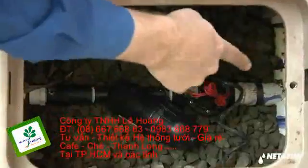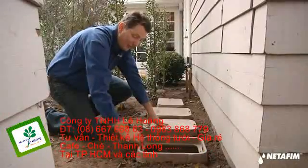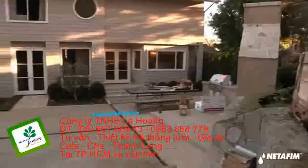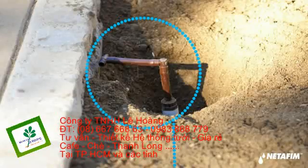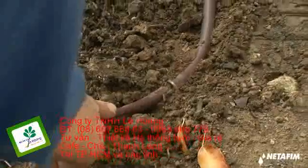You can see right here, the water comes through this mainline pipe, goes into the PVC pipe, starts here, goes across right below the soil — in this case 6 or 12 inches down — and the PVC pipe will come out where we have our stub up, so we can irrigate directly through this tubing and through the emitters to the roots of the plant.